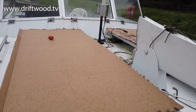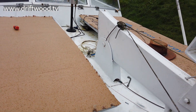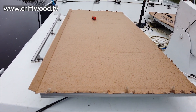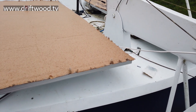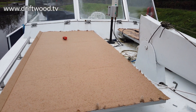Update: I have the two solar panels bolted into place. I'm keeping them covered with cardboard because I haven't connected them to the charge controller or battery yet. The next step is to run the cables from the two solar panels down through and into the boat, then fit the solar charger and connect it all up.